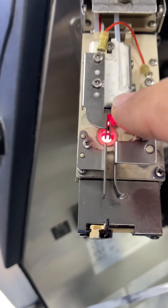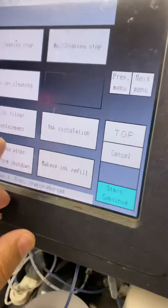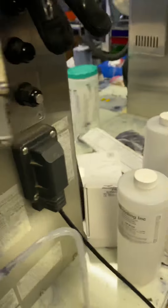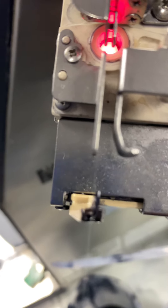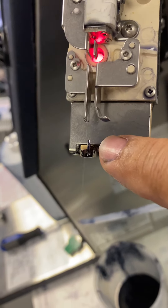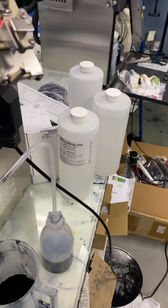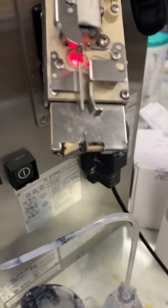Then you can do the nozzle backwash like two times. Once you do the nozzle backwash two times, then you can do the in-stream alignment or in-stream adjustment — start/continue and you're going to get solvent to come out. If it shoots to one side, you see that — I need to clean my orifice again. So I do the nozzle backwash again a couple times. You have to do the nozzle backwash and then the in-stream alignment — that's how you clean that.